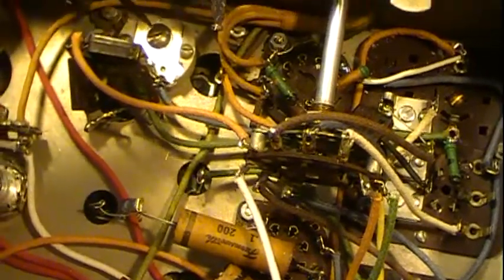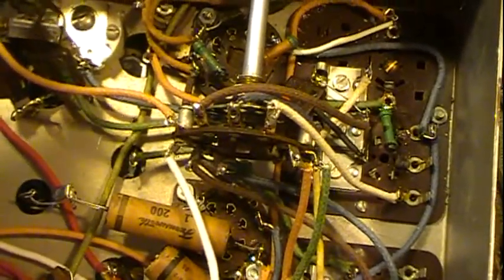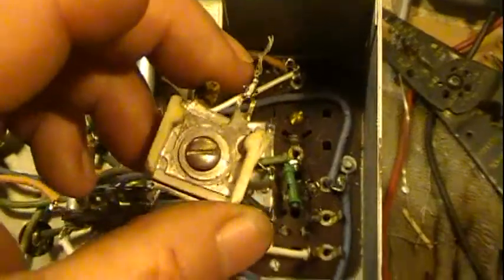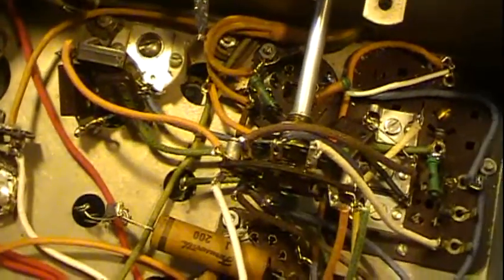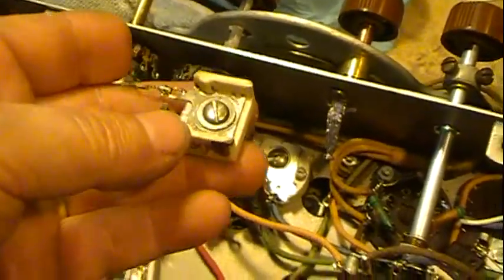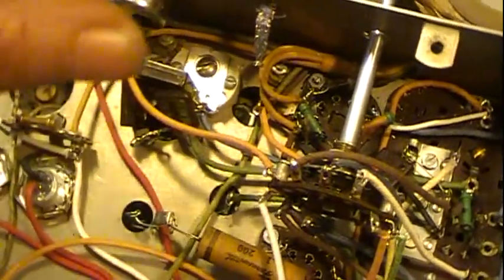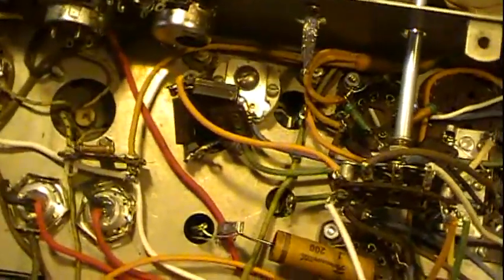The reason for its size is it is a fairly large condenser padder cap, but it isn't like you don't see these in pretty close to that size. You see them more like what I'd call standard size, or something kind of similar, somewhere around this size, or one of these guys down in here size. The difference is I think this one only has 2 plates on it. The ones that are in the smaller package size have like 4 or maybe 6 or 8 metal plates in there. This one I think only has 2 too, but it's a low picofarad cap. In later radios, one thing they did was they actually added more plates. More plates, you have more capacitance, so you can make the package smaller. So anyway, I hope that answered that question.